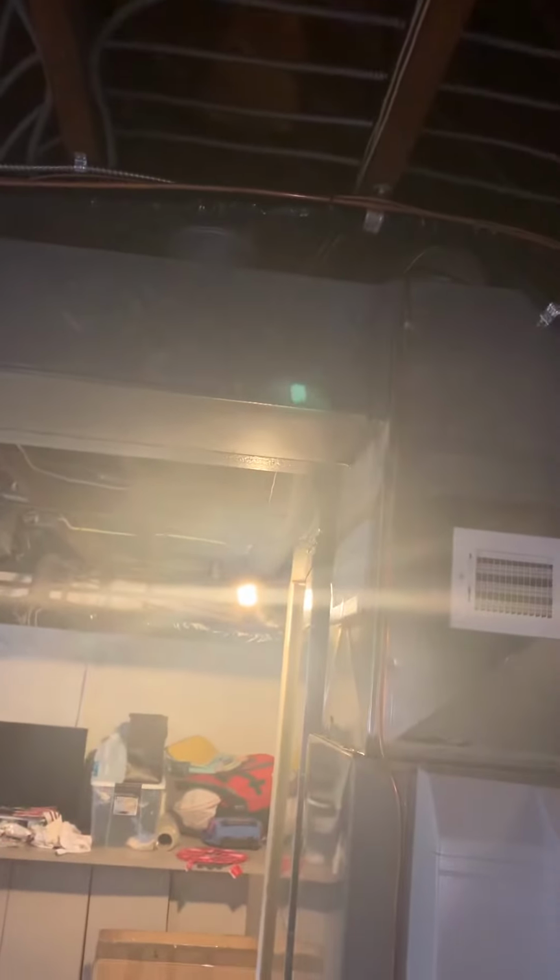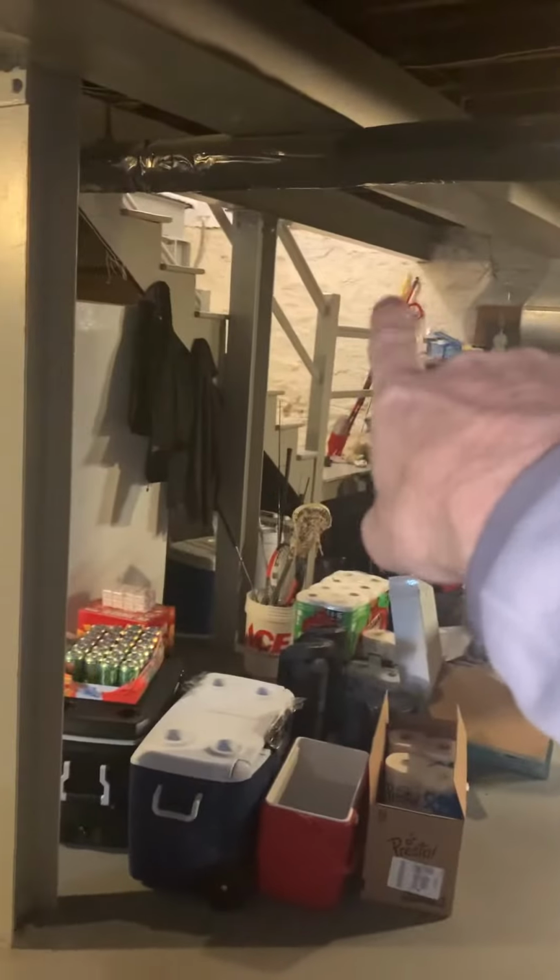Okay, we're taking a look at a few options here to increase airflow to the, I guess let's say the sitting area or family room over in this area. So we've got 8x12 duct running this way, 8x16 running this way. A couple manual dampers was talked about.